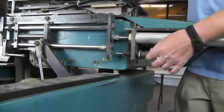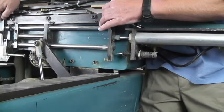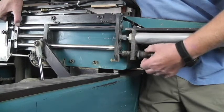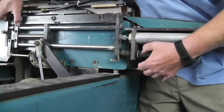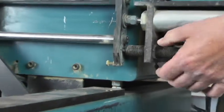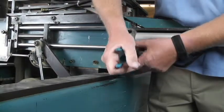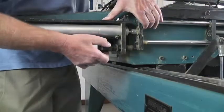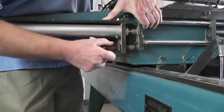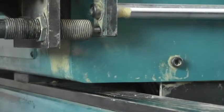This is the shock absorber that stops the feed at the end of its stroke. The shock absorber has about a one-inch stroke. When the feed comes all the way up to the feed stops, we want it to depress the shock absorber about three-quarters of an inch. So there's about a quarter of an inch of it showing, and then we can lock a lock nut up against there to hold it in place. Use a standard pair of channel locks to tighten the lock nut. On the removal end of the saw, set the shock absorber so that when the feed is up against the feed stops, it depresses the shock absorber about three-quarters of an inch, and lock the lock nut to hold it in place.